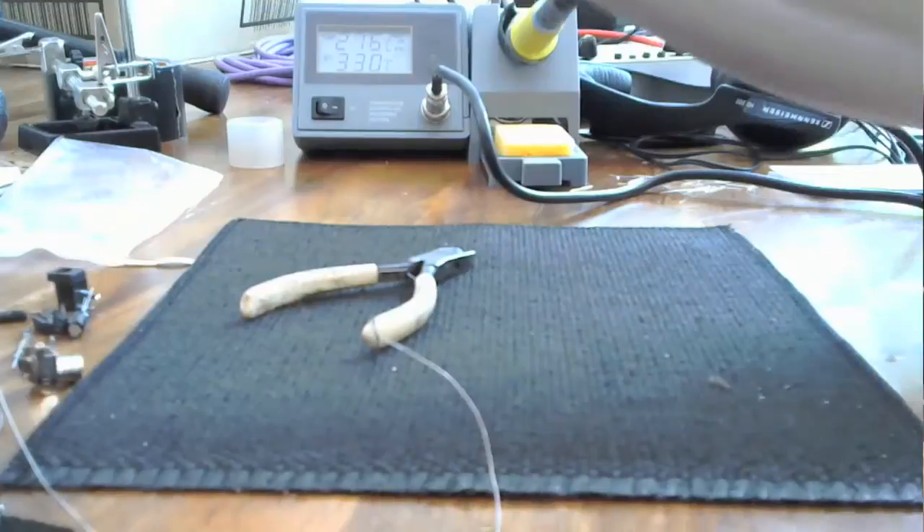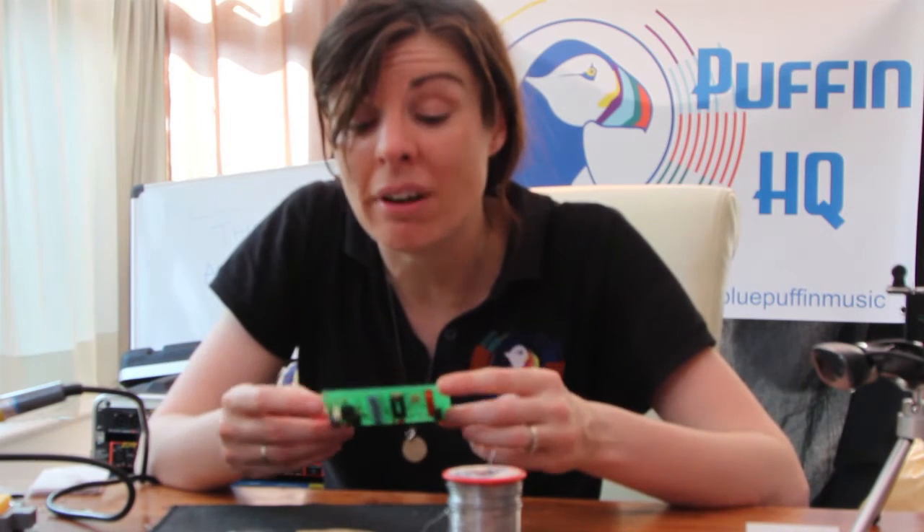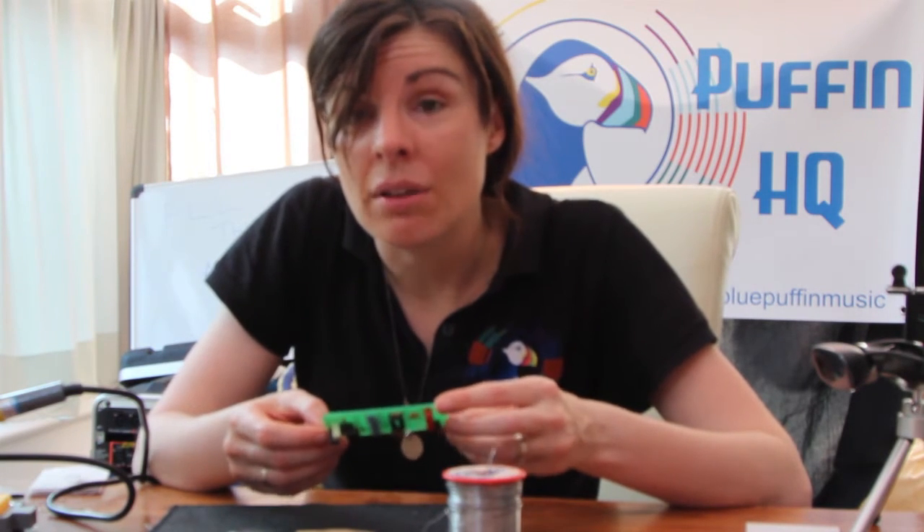Had a bit of an intermission to cool down, mainly for the equipment actually. Everything is maxing out — we're going to be in a horrible bonfire type situation. Got a few more bits done off camera, just to save you the tedium of watching a woman solder. What I find hardest is these little holders for the integrated circuits. What's tricky about them is the leads are all very close together, so you have to be really careful that you don't create any connections where you don't want them.